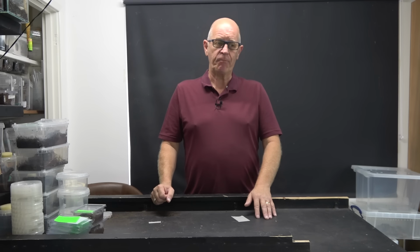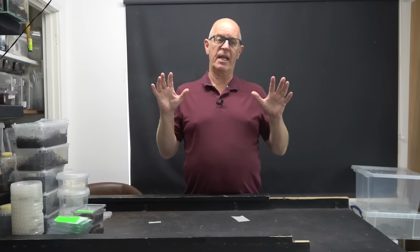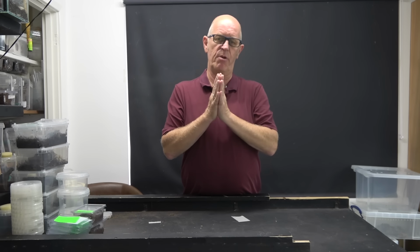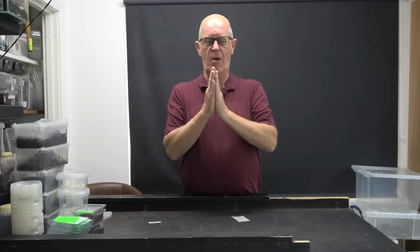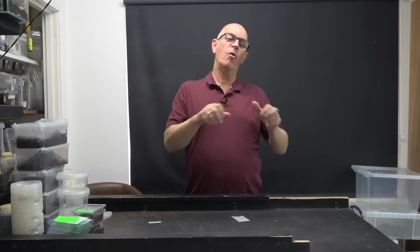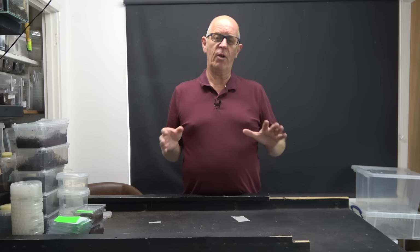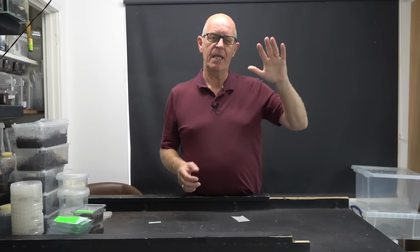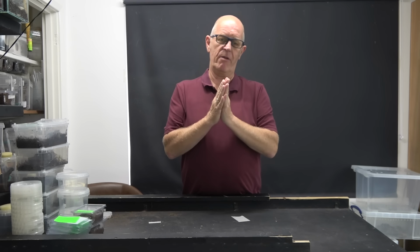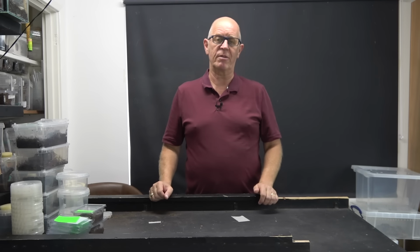Done an amazing job. Now then, you would have seen there that we put the breathable membrane down on the panels, and as the name suggests, it's breathable. What that means is it covers the wood, but it allows the wood to breathe. It's like a one-way barrier, so it allows it to breathe, but it won't absorb back in the other way. And one of the comments we had was, oh, you didn't tape up the joins. Well, it's a purpose thing. We didn't tape the joins up because they don't need to be taped up. We're not looking at sealing it. It's not a complete waterproof barrier. The whole point is that it's there to stop moisture coming in, but it allows it to breathe out. So there is no need. We could have taped it, it wouldn't make any difference, but you're not actually achieving anything by taping it, and that is why it wasn't done.